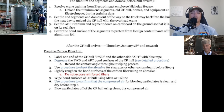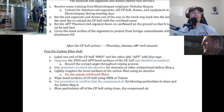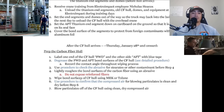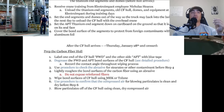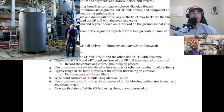Next they're going to prep the carbon fiber hull — taking some masking tape to label one end forward and one end aft with blue masking tape, then degrease the bonding surfaces. It says to wipe the surfaces of the carbon fiber hull using MEK or toluene — those are common chemicals we use in the diving industry when we need to patch, like patching dry suits or a lift bag, so that the glue can really adhere to whatever surface we're putting it on.